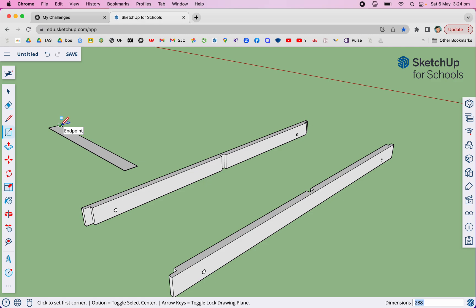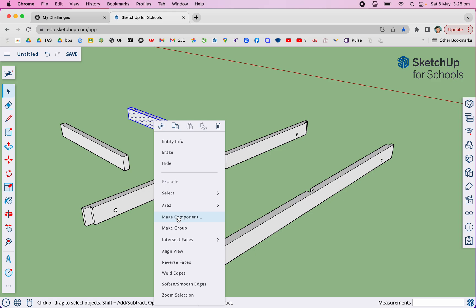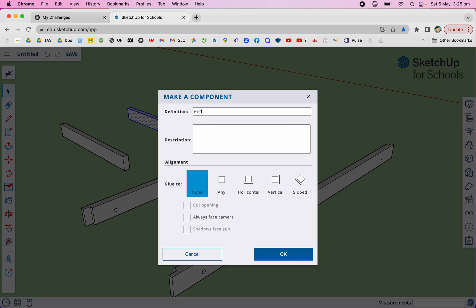The 288 comes from — see, the box is going to be 600 by 300 when it's finished, but because that fits in that rebate it's 300 minus 12, so the total will be 300 but this length needs to be 288. So 288 comma 12 — and then bring that up 30. That's all that happens with that piece. I'll make one copy of it — move that one across a little bit. While that one's selected I'll double click, make a component, and this one I'll call 'end'.